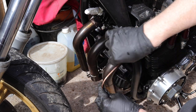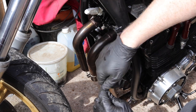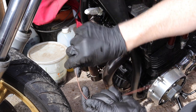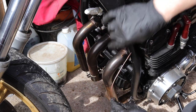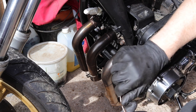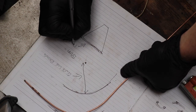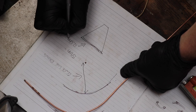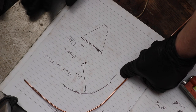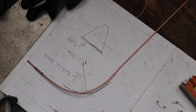I've taken that measurement and then I will put it onto a bit of paper and try and figure out what the closest centerline radius equals in terms of a circle size. What I can do then is plug that into a pie cut calculator. The link is in the description below for the one that I borrowed. Thanks very much, whoever you are, that's very helpful. I'm planning on maintaining the same radius all the way throughout, so once I've got that set, I'll cut a few bits, make sure I'm happy with it. If that's good, then I'll proceed and just cut the rest of the pie cuts.